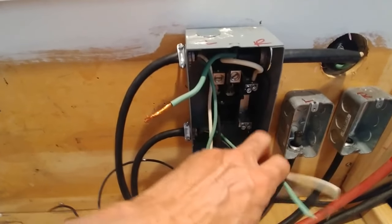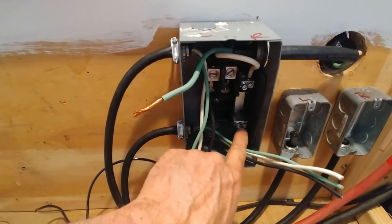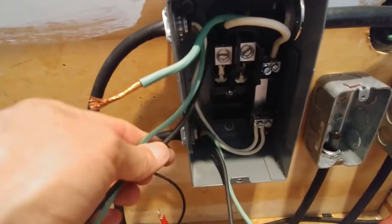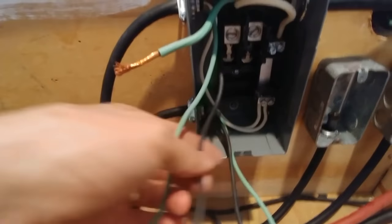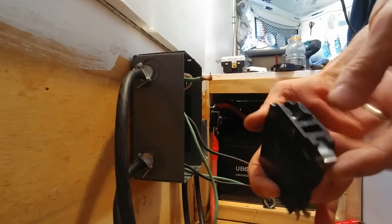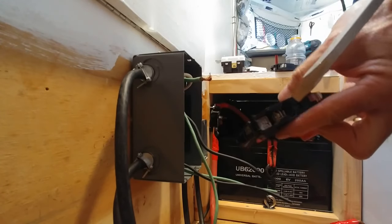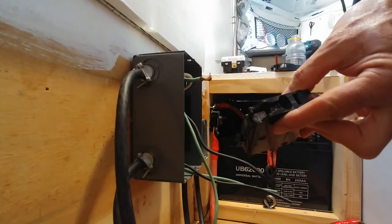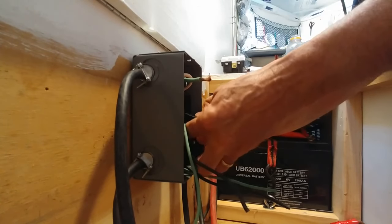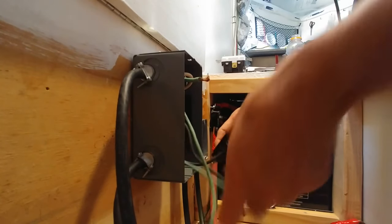First step is to strip both white wires and plug them into the neutral bar — we've got two screw holes, so we're going to put both white wires right there. As you can see, I've got the two white wires screwed in. Now we've got to strip the black wires and attach them to one side of the breaker and snap them in. The breakers have a screw on this side, so back the screw off, stick the black wire in, and tighten it up to pinch it in there. Then snap the breaker in — bottom first, then tilt it up — and the black wire will be hooked on underneath. You can see the black wire attached and the screw is tight.